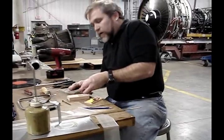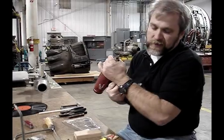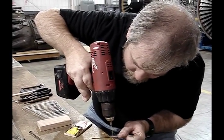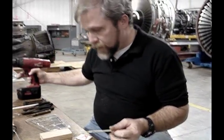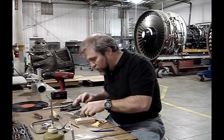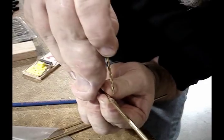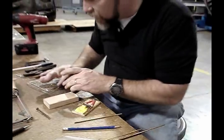Over to our drill bits — we get the smallest drill bit, a 1/16th inch drill bit, and we're going to go ahead and drill a hole in that rod. You've got to be really careful because these bits break real easy at 1/16th of an inch. Now I'm going to use my next size up drill bit to deburr the edge of the hole. Just stick the drill bit right there and turn it by hand — just a couple of sizes up. That makes it less likely to cut through our string.